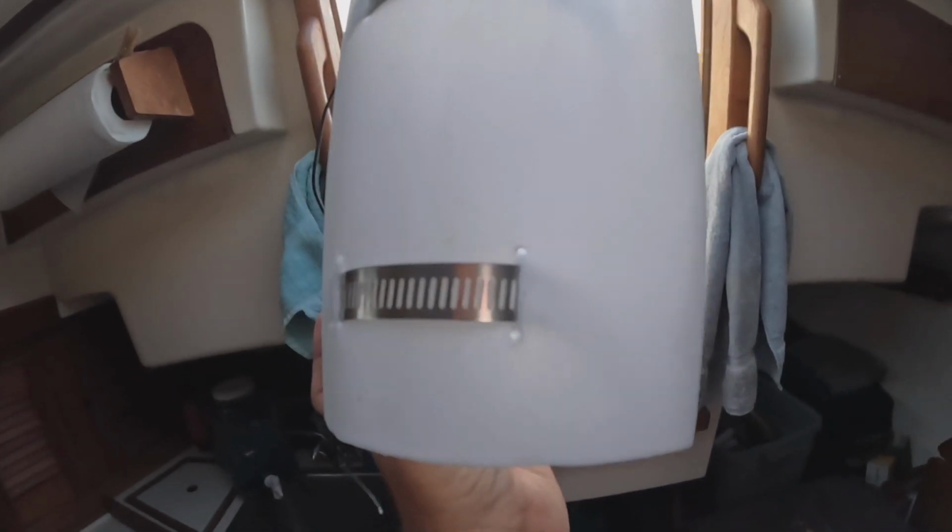Here's some exterior detail. See, there's the slots, the little slits where the hose clamps come in and out. I drilled little holes. That's why I had the Makita out there. I drilled little holes at the end of the slots, because I was afraid that if I just cut little slits, the ends of the slits would keep on ripping. And so with the holes, that should prevent them. It's kind of an engineering thing, like why airplane windows don't have sharp corners,